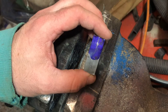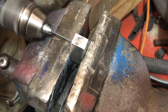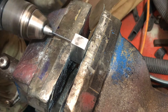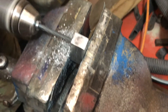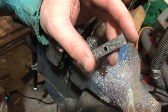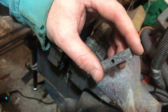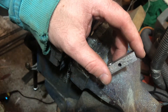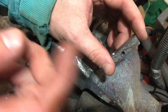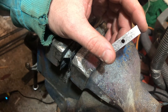The next step is to drill that 10mm. Next step then is to tap this - for M6 thread it's a 5mm drill size. I'm going to drill all the way through 5mm and tap all the way through, and then once I've split it down the middle I'm going to come in with the reamer to pre-drill it and ream it to remove the threads on one of the sides.